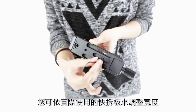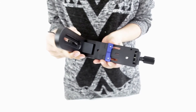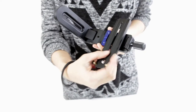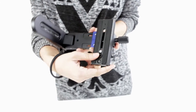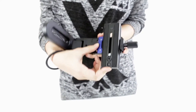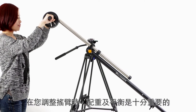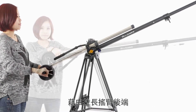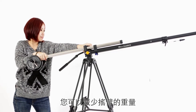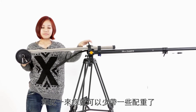The weights can be adjusted according to your payload weights. It's really important when operating a jib like this. You can reduce the counterweight by extending the rear part of the system, giving you the option of less counterweight to carry.